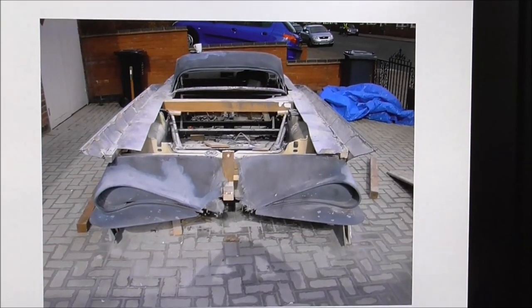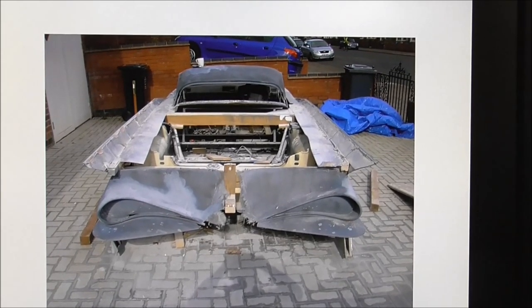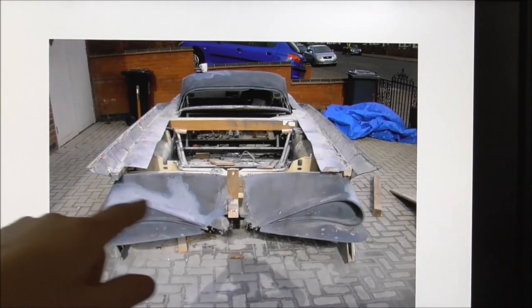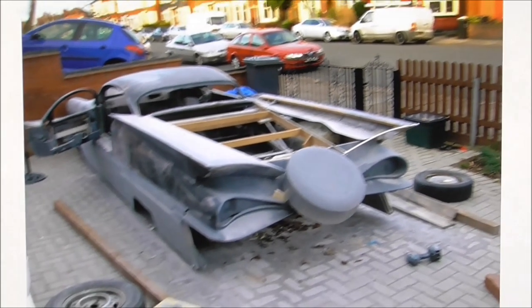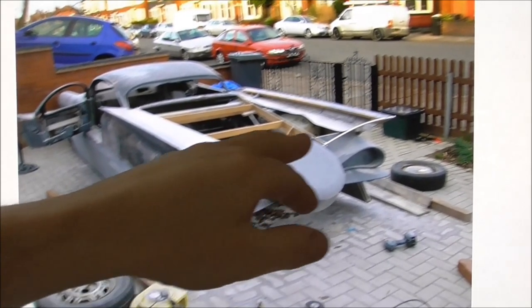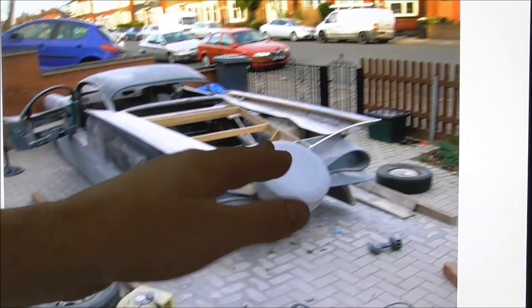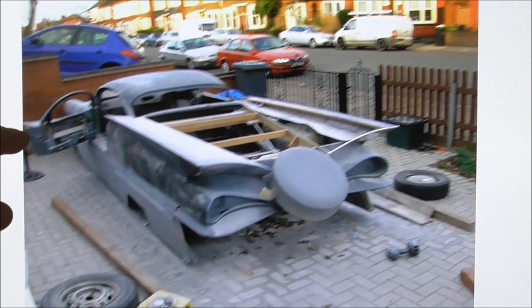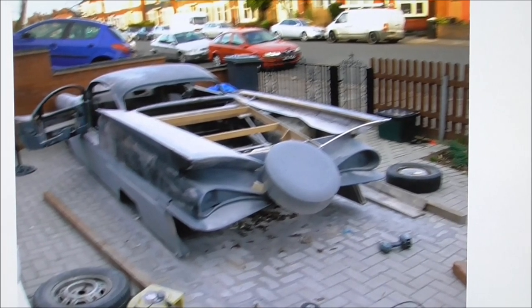In this picture you can see the rear lights. I really like this teardrop rear light look. I'd been looking at George Barris' car that he built in the 60s — the Buddha Buggy — and I thought, wow, that's what I've got to do. So using aluminium tube bent around my knee, I bent these in and then fibreglass up to them. Moving on — this is obviously when I'd been sanding all day. I made the continental kit from scratch from a piece of plywood, then bent the aluminium around it to give it a dome shape. And we have a door that swings. I always say with most of my cars, making the door from scratch takes all the time of the build — the rest is thrown together in an afternoon.